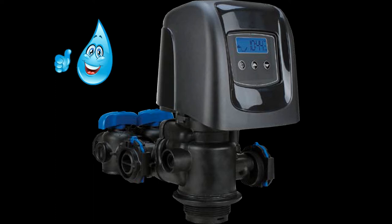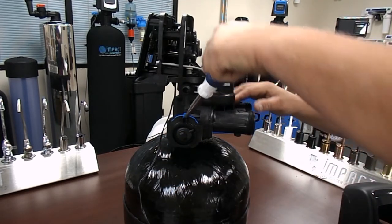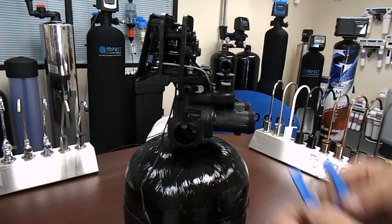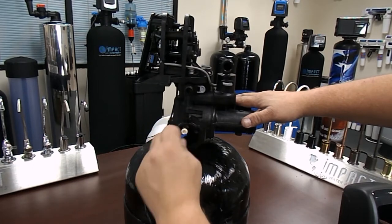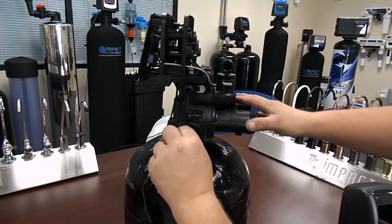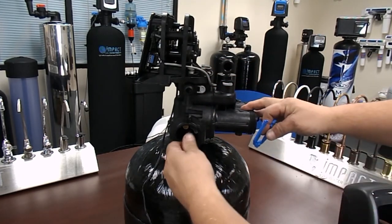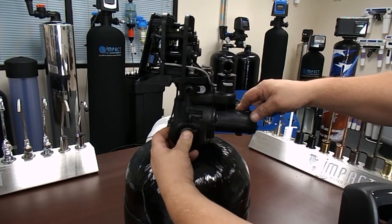Your valve is now rebuilt and ready to be put back in service. Other serviceable items on the 5810 and 5812 include the injector assembly. The blue clip is designed to break for your safety if you do not depressurize the system prior to removal. Once you depressurize the system, push in the cap — it should go in about a sixteenth of an inch. The blue clip is then easily removed with a screwdriver. The blue clip also doubles as an injector removal tool. There are two injector holes: one is used for upflow, the other for downflow, and the unused hole is plugged with an injector plug. In filter systems there will be two injector plugs. The injector screen is inside the injector assembly and is easily removed for cleaning. Reinstall the cap and the blue clip and you're ready to go back into service.